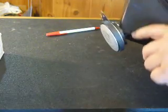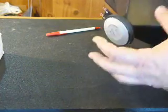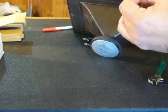They are repairable because you can see that we have the nuts on here, so this can actually be taken apart and serviced. What we're going to do is put a new voice coil unit in here. This is what the new one looks like. I got these from SpringfieldSpeakerRepair.com — I found those guys on eBay. I think they were like 17 bucks a pop.